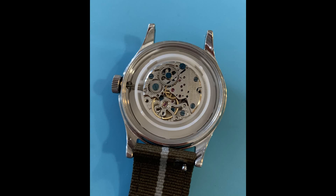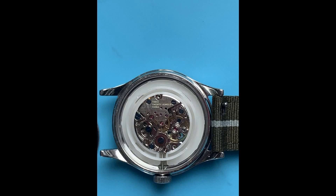Here we have the watch with the snap-on case back removed. I was immediately struck by two things: first, this movement is skeletonized and has some minor but fun decoration, as you'll see later; and second, it's extraordinarily small. Next, we can see the movement is stamped with three lines — Timex, 20 jewels, and China. While Timex uses Miyota movements in some of their other mechanical watches, this isn't the case here. I searched AliExpress for a similar movement and was unable to find a similar 20-jewel hand-winding movement that also hacked. Perhaps this is a Timex-commissioned or designed movement manufactured in China? If anyone recognizes this movement or knows more, please leave a comment below.